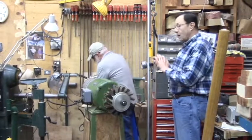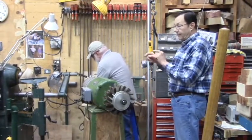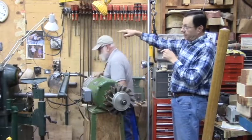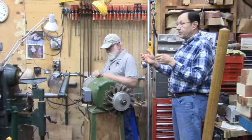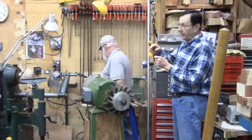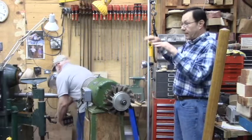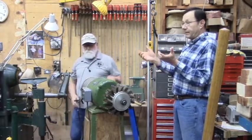All right. Well, there's something we didn't talk about, which was the advantage of a variable frequency drive in terms of the type of machine that you're using. So if you bought, say, a 3-phase drill press, instead of changing your belts for your speeds, it allows you to change the speed based on the drill bit that you're using. Each cutting tool has a feet per minute. So instead of just going with an average, which is what a 4-speed pulley or a 9-speed pulley setup would be, you can dial it right into the exact speed per minute that the drill bit calls for.